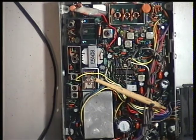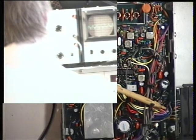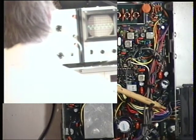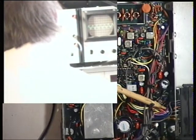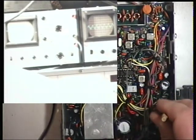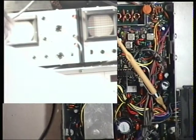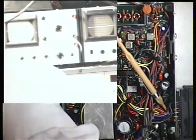I'm going to transmit. I'll switch the other camera on so you can see this as well. So we're into transmit. I've got 1 kilohertz deviation. And there we have 2.5. Okay, so that's fair enough.